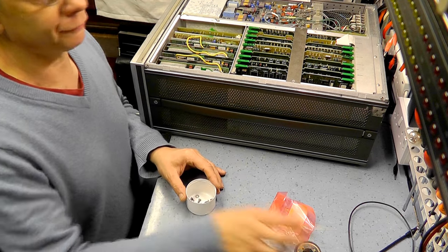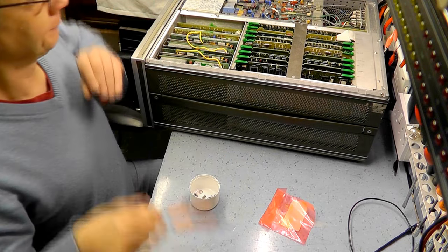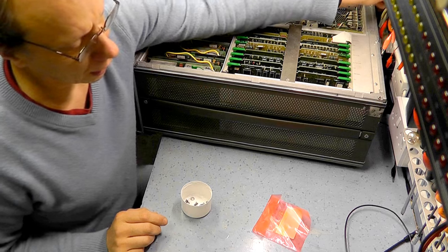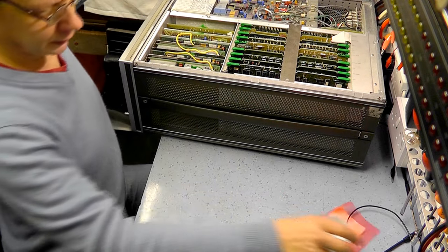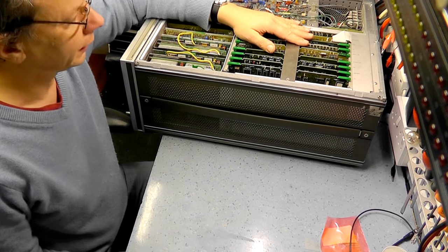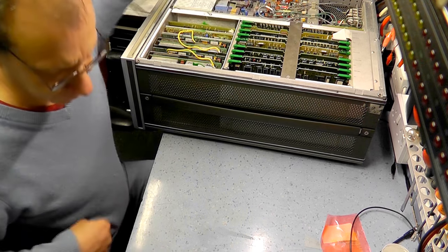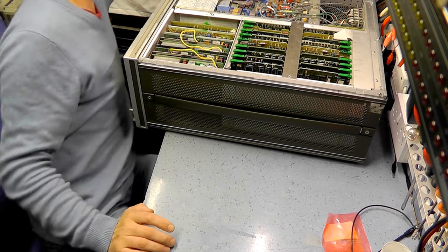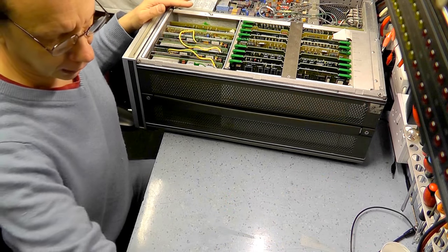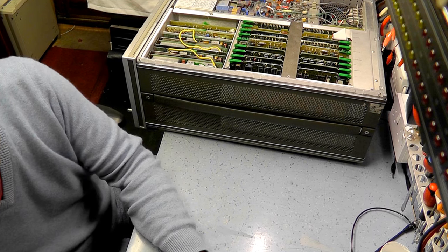I was thinking last night, after I had changed that relay — did it actually need that A5 board I replaced? So I plugged the older A5 board back in and it came up with a pass again. I was thinking, oh what a waste of money — about 120 quid for the board. But when I actually delved into it deeper, it was actually failing. The A5 board was failing on the digital side, so there was definitely a problem with it, and the other one did fix that.